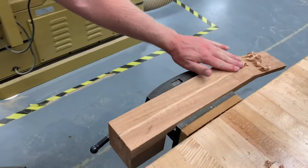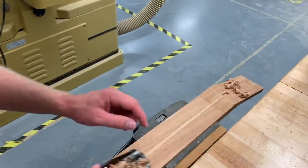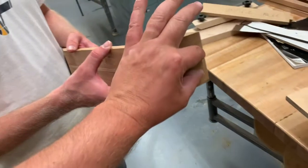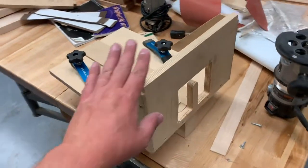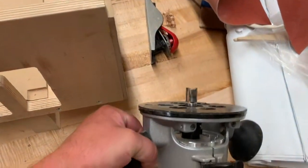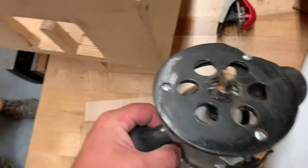You can feel if it's flat anywhere, and any high spots you can still hit if needed, or just clean it up with that hand plane. We're going to cut a tenon on the very end of our neck here. I've got a jig we're going to use for cutting that, and also a router with a straight cutting bit that has a little ball bearing at the bottom.